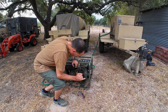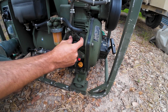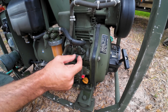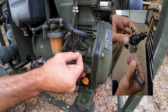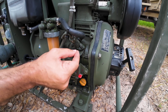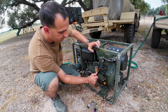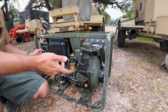So that was a 30 count; I'm letting the starter cool off. One thing I'd like to add: if there's any sign that these bolts have been taken off and this injection pump has come out, you want to undo this little inspection hole right here — just this one bolt — and make sure by moving it to the middle that the nipple on this pump that controls the throttle and fuel delivery is inside the governor fork. Because a lot of people ignorant to these don't know any better, just put it in, and the engine could run away from you. Now I'm going to crank it over and see if the engine will start to start.